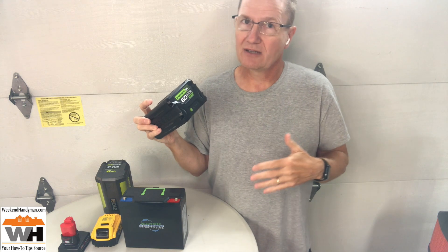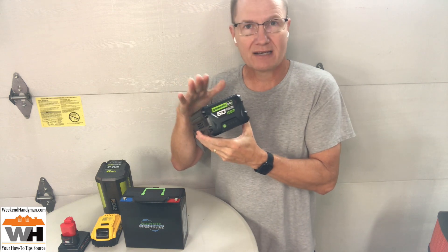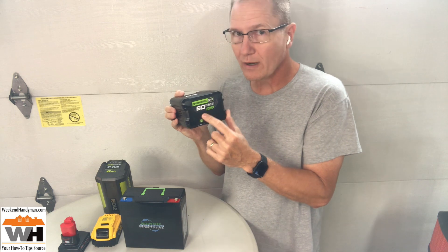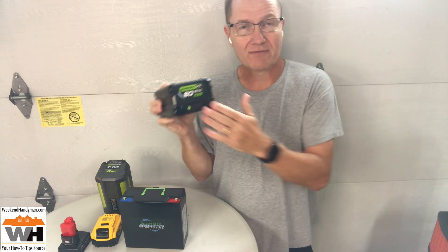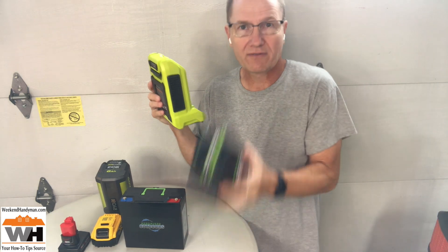This is a lithium-based battery, so it's going to be closer to 100%. So our 60 times our 2 is 120 watts of available power. If this was on an inverter, the inverter itself is going to have some efficiency issues — they're not 100%. So let's take this 120; because of maybe some battery inefficiency, let's take it down to 100 watts of available power coming out of this. Then our inverter is going to also have some inefficiency. The rule is kind of going down to 85% of that. So our inverter is going to lose roughly 15%, meaning of the 100 watts available, we're going to be down to really 85 watts potential to use for our device when converting to our outlet.